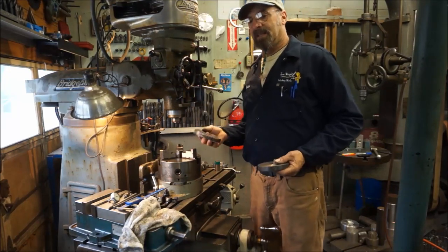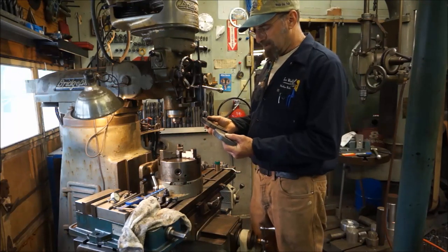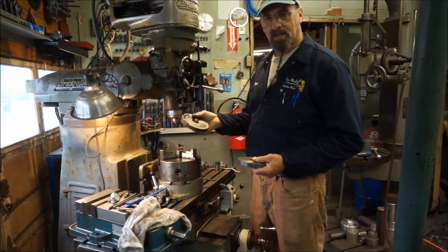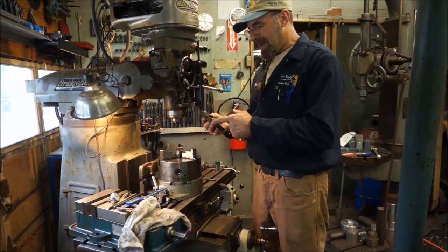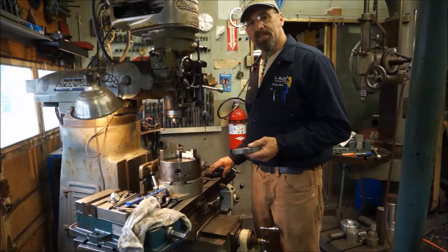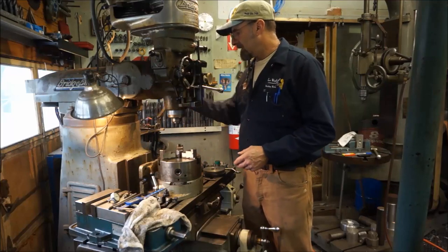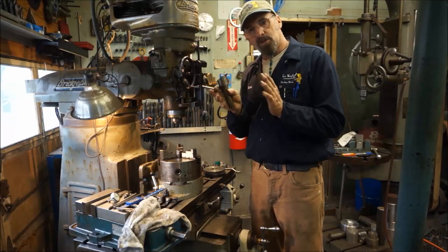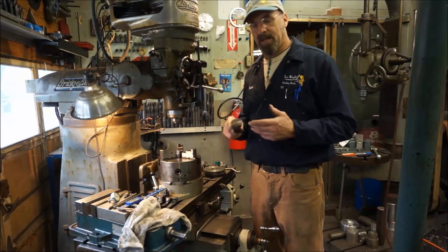I mean, it's not going to be the same as once it's rolling on a spindle and under its own pressure, and we'd see how that repair actually came about. And I basically did that to show you how I would go about it. Now, as far as teeth being cut, I used the cutter because I had it set up for this right here, but you could actually hand grind the involute shape for a gear tooth, and you could single point it basically with a fly cutter.